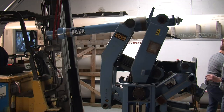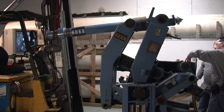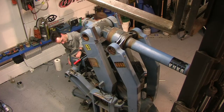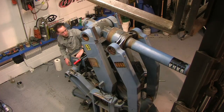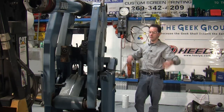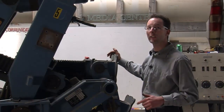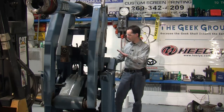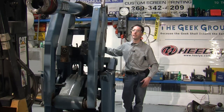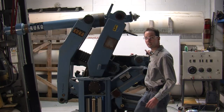So now we take the shaft off the line. We need a way to lock that in place — a random piece of scrap steel should do it. Because if we can lock this in place, I can take the tension off that and we can sling it and then just disconnect it and take it right off. So that was our first step of the process: getting this disconnected, getting the motors off, and getting the arm up so that we can now disconnect the arm. We'll be back in the next video for actually taking off the arm. You guys have fun — we'll have more for you next time.